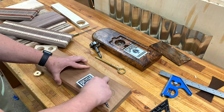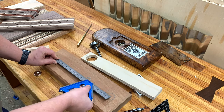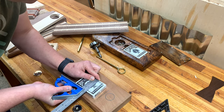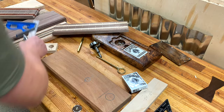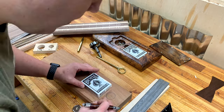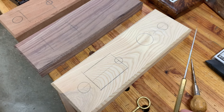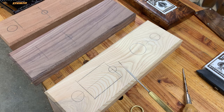You really do want to have that finger grip on the other side — I'll talk more about that later. You're just tracing out where you want the card storage and where you want the big circle — that's about a two-inch circle for the pegs. You want to tilt it toward the end, especially if you're planning on a swivel board. If you're doing cards and peg storage, put the pegs a little on the end to make room for the cribbage board in the middle. Mark everything out, get nice clean lines with your pencil, then use an awl or an ice pick to add starting points, especially for the Forstner bits, so they get locked in.